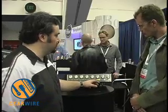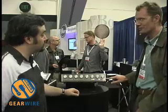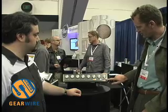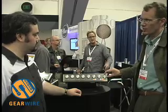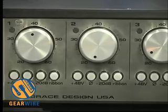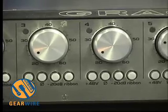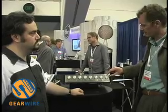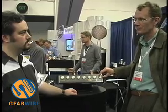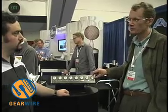The other controls — it's a very clean, very simple faceplate design with a brushed aluminum... actually it's stainless steel. You have a 20 dB attenuator, phase reverse control, and if you're not in ribbon mode, you have phantom power. The gain controls are gold-plated 24-position Swiss-made rotary switches — ELMA switches. They're detented switches that use precision metal film resistors for each gain step. We don't use potentiometers for setting the gain in a mic preamplifier. Potentiometers have too many non-linearities and it's difficult to get repeatable gain settings, especially at high gain levels. So all of our mic preamps use switched precision metal film resistors for the gain setting.